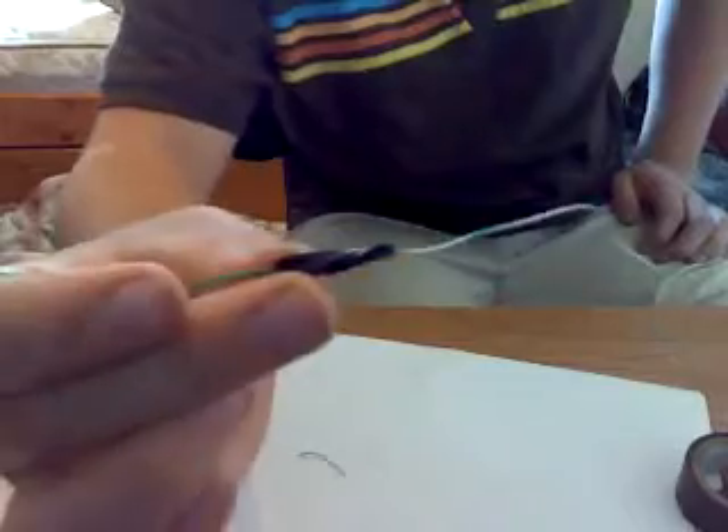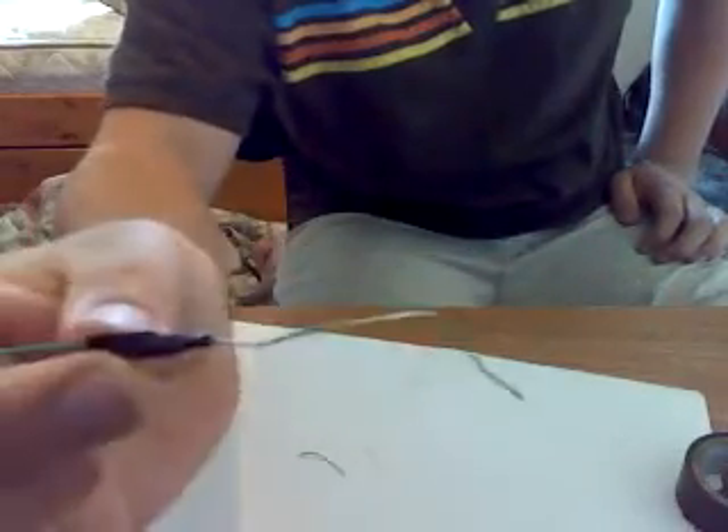The taping is pretty self-explanatory, but just take the tip of the tape, put your copper not too far from the end but not right on it, then bend that little piece of tape over it and hold it, then bend the rest over. You should get something like this, then kind of twist your tape around to form a tighter connection. Do that for all your other cables, and make sure to match your cables — green to green, striped green to striped green, orange to orange, and so on.